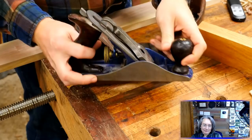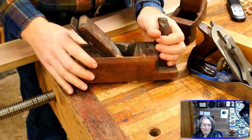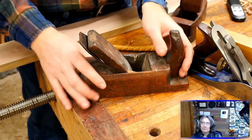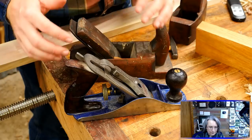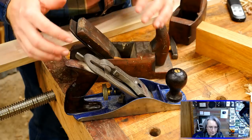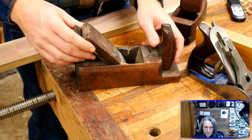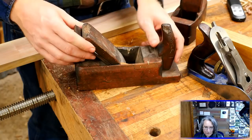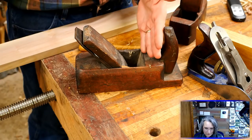For a long time, wooden planes were the thing — that was what everyone knew. You grew up on adjusting them, and once you understand their adjustment they're fairly simple. But then Bailey and others came along with steel planes that have all these adjustability features. With levers and knobs you can fine-tune the adjustment far more accurately than you can with a mallet, unless you have the skill. The big difference is a metal plane doesn't take as much skill to adjust — you just move the knob. With a wooden plane, it takes skill because it's all about how much you hit the iron, how much you hit the wedge, where you hit the body, and how hard. Those are skills you can only learn by doing.